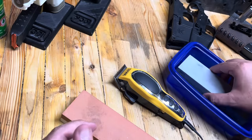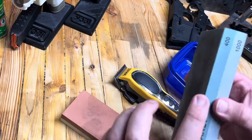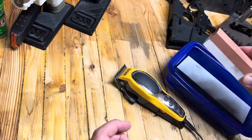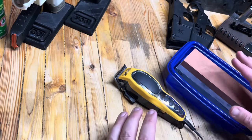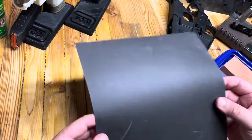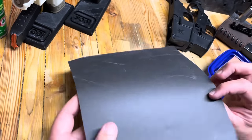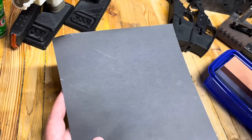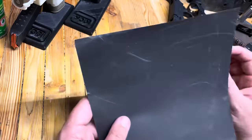I have a little trough here for our water. In here we have a sharpening stone — this one is 1,000 grit, which is what I'll start with. I won't use the 400, and then we will finish off with an 8,000 grit. Now if you don't have knife sharpening stones and you're not interested in sharpening knives, you don't need to go buy these things. It is entirely possible to do this job with just a sheet of sandpaper. I would recommend doing a 1,000 and a 2,000. If you can go higher, nothing wrong with that — you're pretty much just polishing after 1,000 anyway. Don't use 600; that's too aggressive.